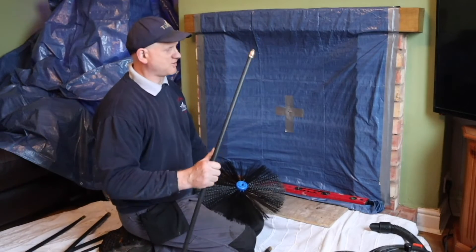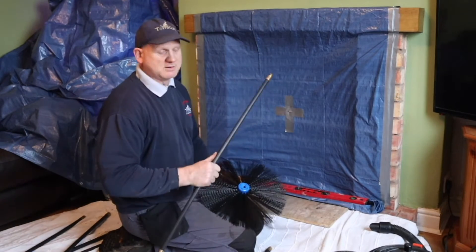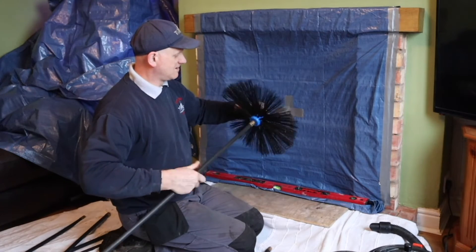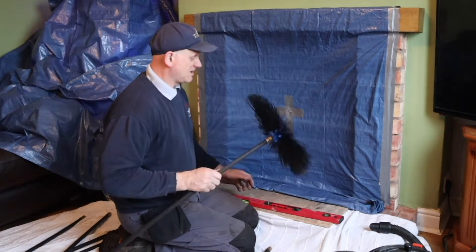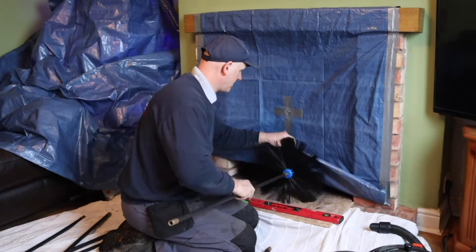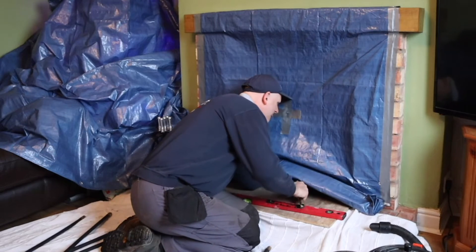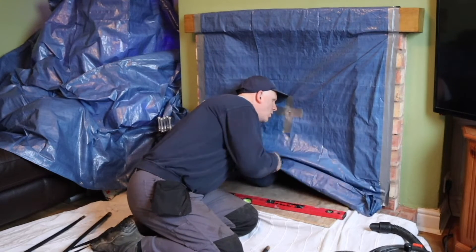The first thing I'm going to do is put the rods through and gauge the height to make sure everything's clear — I'm not trying to force the brush through. I can only get six rods up and I can't push it anymore; I think it's because it's not centralizing in the actual chimney. So I'm going to put that under here and then come through my hole.